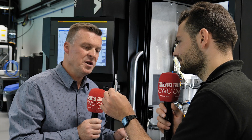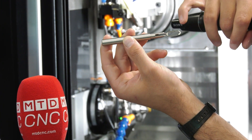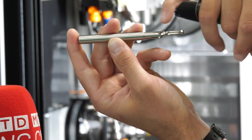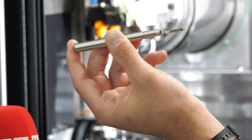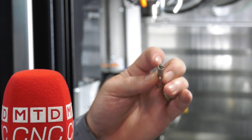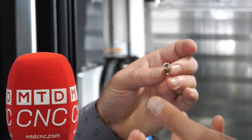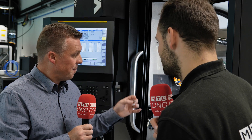This is a job for medical instruments. When you've got a part like this, the head comes in and you machine all these crazy features — five-axis stuff, standard profile milling, drilling, engraving, loads of beautiful curves, radii, tangents, and tapered pockets. Then you grab it here with the vise, and there's a complex operation on the other side. This is the finished part: you have all the first operation features, and the simultaneous machining covers all the inside area — loads of features, a couple of drills of different sizes, deep milling operations, profiling, and chamfering.